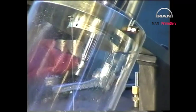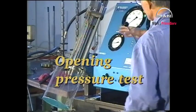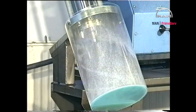Oil must not seep from the fuel valve nozzle holes until reaching a pressure of 50 bar below the specified opening pressure. If oil does seep from the fuel valve nozzles, see Procedure number 909. Lapping of the internal seatings is not acceptable. Pump 5 to 10 strokes to fully open the valve and to blow out any dirt. Then relieve the pressure.